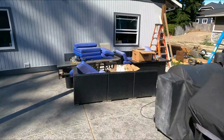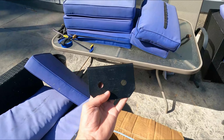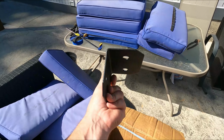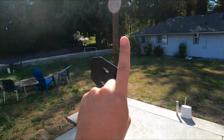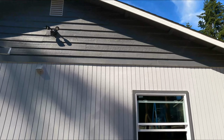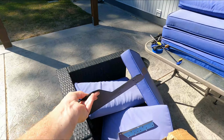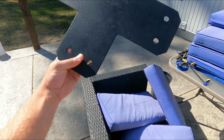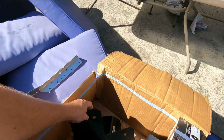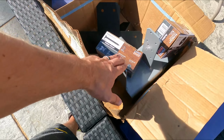Like, I'll show you these we have here. So something like this, which is a 6x6 L bracket. This I'm just adding for additional structural integrity of the post that goes in between the middle, that goes up as a jack to the beam that runs across the top. And then it's just got your standard flat T that you'll probably see. This is typically the most widely used bracket with these sorts of things, but I like the way that these look. They work quite a bit more.